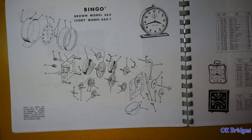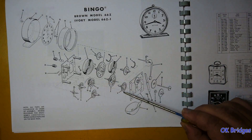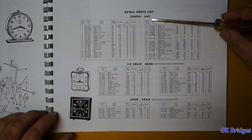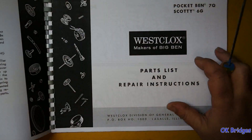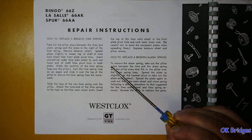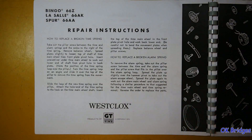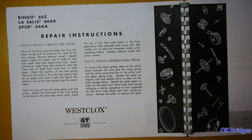There's a nice exploded view showing how the parts are supposed to go together — little dashed lines showing everything exploded out. Bingo parts list, La Salida parts list, and Spur parts list showing parts that differ for each model and then common parts. The repair instructions talk about loosening screws and springing the plates. I've never really attempted to replace a mainspring using these methods — it seems like it might cause damage. It shows the shortcuts they were recommending to make repairs that a clockmaker generally would not do.